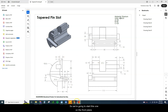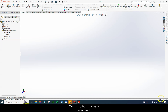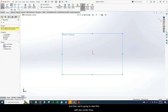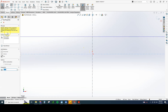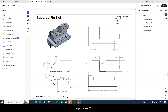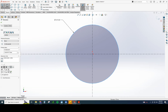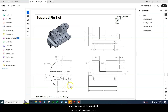We're going to start this one on the front plane — front plane sketch — and it's going to be set up in MMGS. We're going to start with two centerlines: one vertical and one horizontal. These are just construction lines for us to be able to draw what we need. Then we go right here on the origin and draw a circle. A was 50, that's the radius, so the diameter is going to be 100.